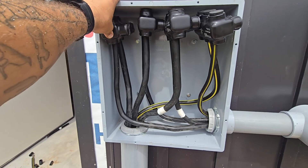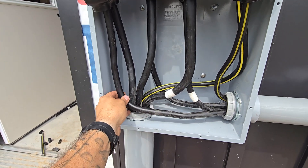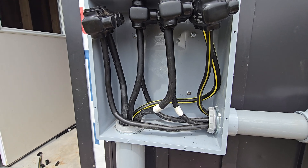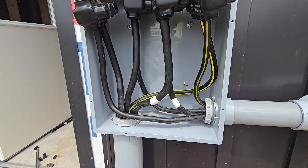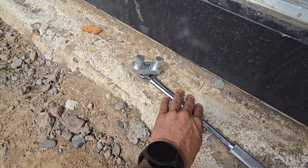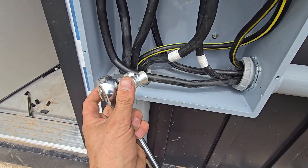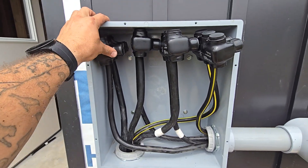It's extremely hard to bend these wires — they're bigger than my thumb. The 350 MCM is very stiff; the four-aught you can play with a lot more easily, especially if it's warm out. In the middle of winter when it's cold, the metal is tougher and the plastic insulation turns into extremely hard plastic that doesn't bend much. I recommend a tool like this — there are many versions, but this one is great because it attaches to any size ratchet. It pops right over the cable and lets you make nice, controlled bends. I've got everything stuffed in here — tight, but it'll do the job.